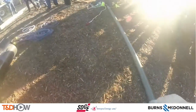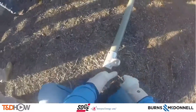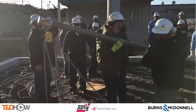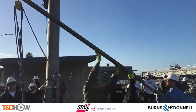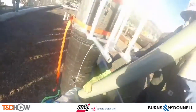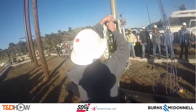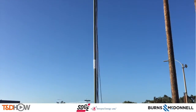Now let's listen to Eddie for a bit. As Eddie notes, getting the gin into position requires the right angle — 'This thing barely fits through there. You got to get it at the right angle.' It's a three-person flagpole raise, and it's heavy. The pole gin then gets set in place inside the cage, the cage is clamped shut, and lines and rigging are attached. We're now looking up at the pole gin, fully rigged and ready to go.